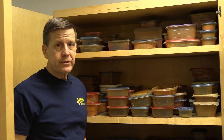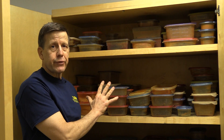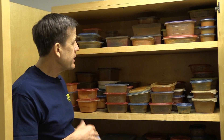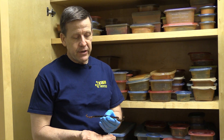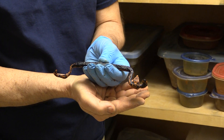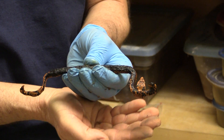Once we're done with the air abrasion portion of the conservation, the artifacts are essentially cleared of all corrosion. We put them on the shelf here in deionized water in order to have the artifact electrically neutralized for the final portion of conservation. For example, this is a handle that has gone through the process and is here being deionized. As you can see, all the gross corrosion has been eliminated — this is what the artifact looks like after it's been air abraded.